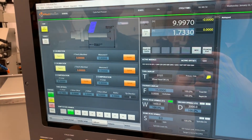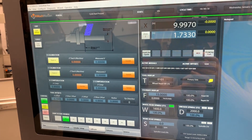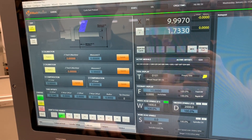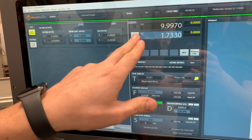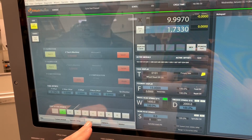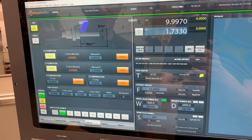Calibration page — this would be where we do our initial calibration. Jog it in, grind on the part a little bit, T-checks, update. You've got your tool offset information. Fixtures — you go to this page and it gives you a zero button up here, or you could type in the position you want for Z. X is always set by the calibration through a teach and learn setup.